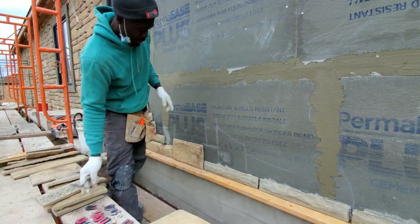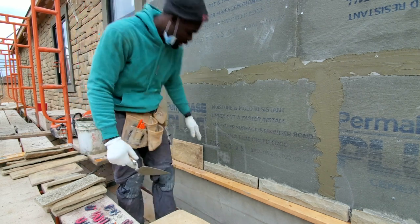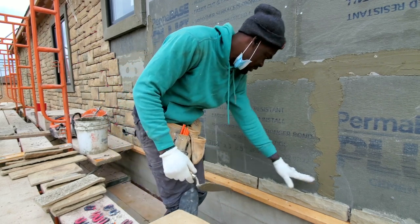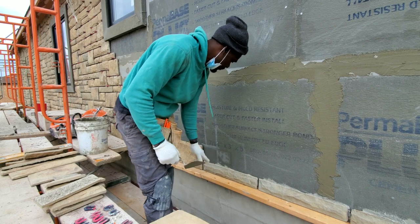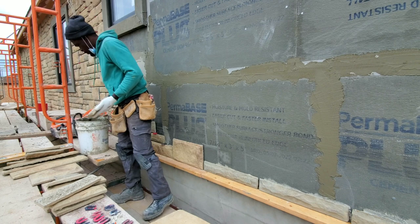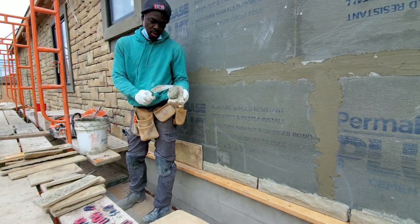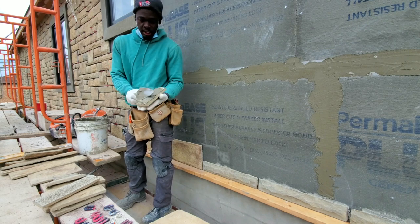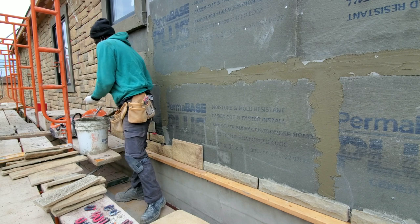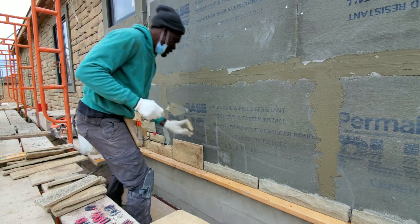As you can see, we've already started our band. Usually you want to lay the same size stone in a row for around two to three feet, and after that we're going to break it — I'll show you what I mean in a second. I have my stone here, just going to apply our mortar right onto it like this. We're looking for quarter to half inch coverage of mortar on our stone.